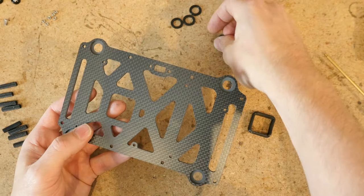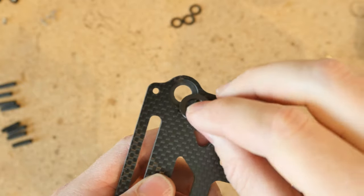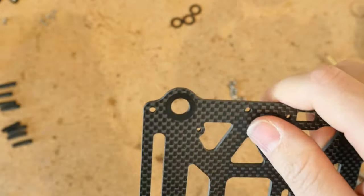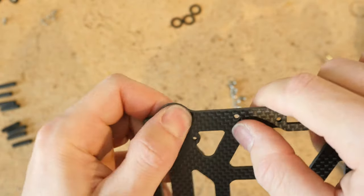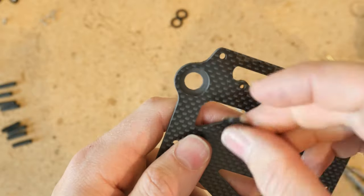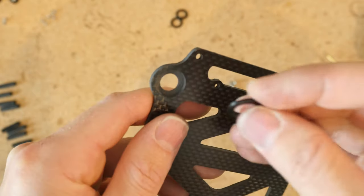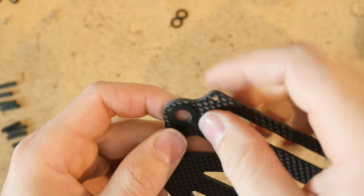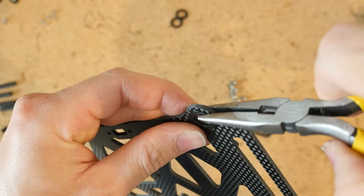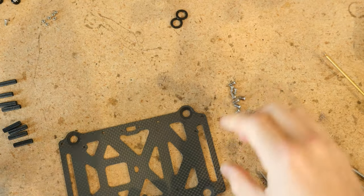Now that we've got the peripherals attached to the PCB, let's move on to preparing the cage. These little 3D printed washers stick right in here — they're gap fillers, space fillers. The purpose of these is so that they can fit the beta gels. Alpha gels require much thinner plate material, but with beta gels it's a much thicker sandwich. It's a little tight, so I'm just going to take some pliers to really jam it in there, or you can use the back of a screwdriver to press it in. All the little pockets are filled with the PLA printed 3D washers.